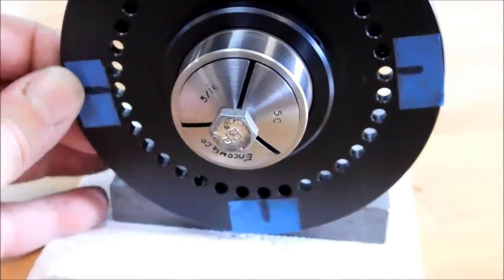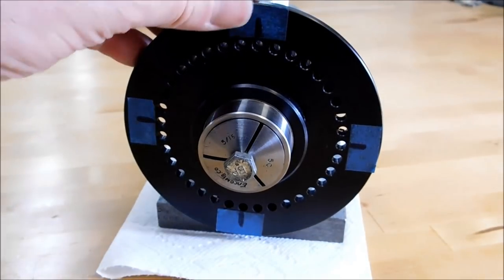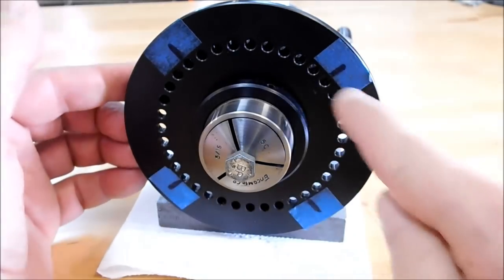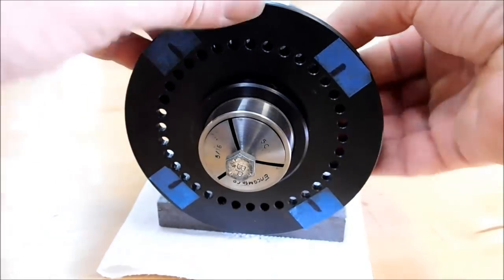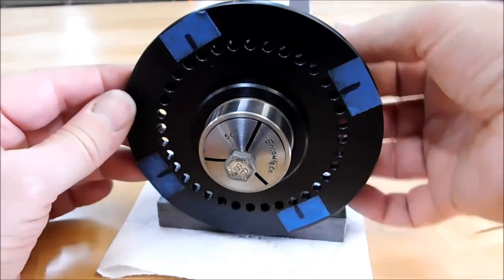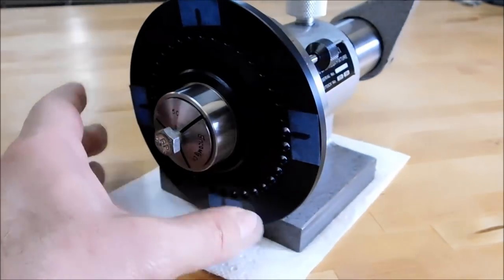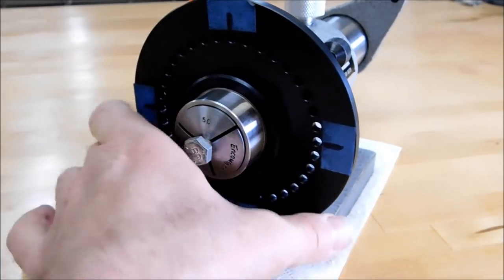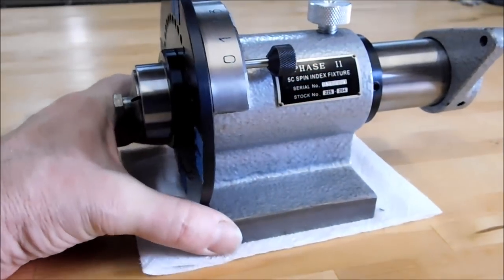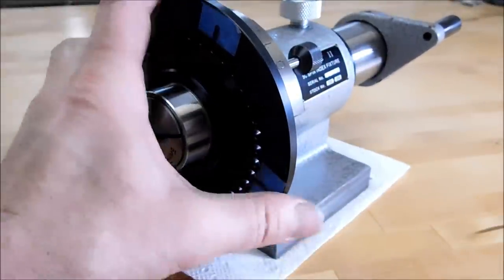This is the type of unit you would use to make something hex, round, octagonal, or whatever shape you want starting with a round part. Whenever I work with this unit, I put tape on the holes that I know are going to be plugged as it comes around, so I can get a quick visual reference whether or not my hole is blocked — whether I'm working at 90-degree, 60-degree, or whatever increments. This is a spin indexer. It's not a super expensive option, but if you're not into spending money for just a couple of pieces, let's go to option two.